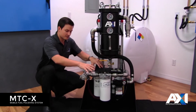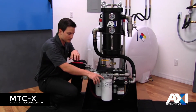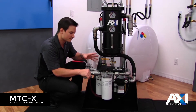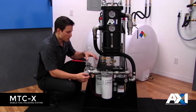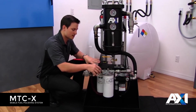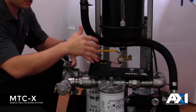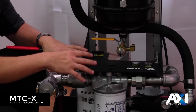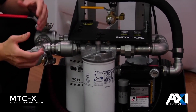On the existing systems, taking off a spin-on filter usually leads to leakage — the plumbing is always full of diesel, and that will spill as soon as you break the seal. What we've done here is put a switch in the back that gives you the ability to drain these two filters. The switch is tied back into the vacuum side of the pre-filter vessel and into the back side of the filters, so we drain and bring air into the filters and drain them down to a comfortable level where you can remove them without spilling fluid everywhere.